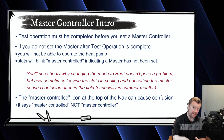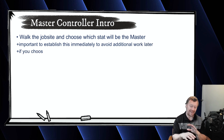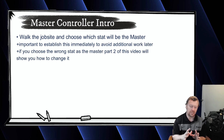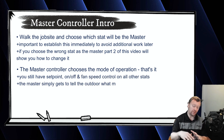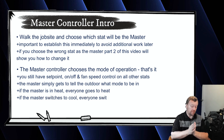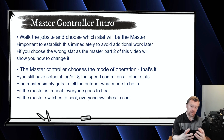So you're going to walk up to the nav controller — the thermostat that you want to set as the master. We've talked about how the nav controller works in several videos. I'll put a card in the corner for my entire nav controller playlist that walks you through in immense detail everything you could need to know about the nav controller. But just for this video, the way that the master works is the master nav controller picks the mode. Everybody else follows that mode. Everyone gets their own on/off, their own fan speed, their own set point, but the master picks the mode. So if the master wants heat, everybody goes to heat automatically. And if the master wants cooling, everyone goes to cooling automatically, regardless of how you feel about that.